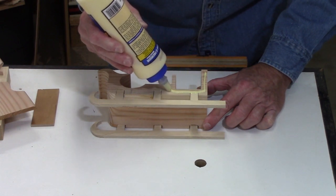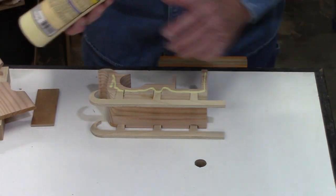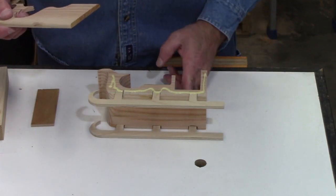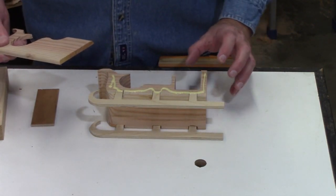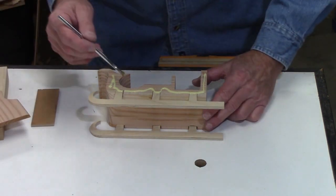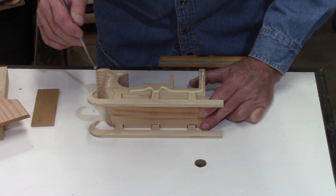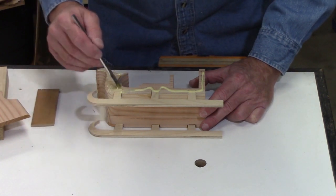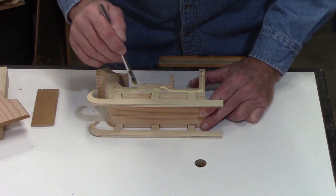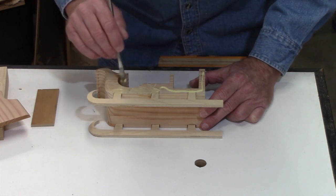And these are going to line up mostly, but you're going to have some issues because you have wood movement. When you start taking off a thin piece of wood, and this is thick, and you take out these blocks, things shrink and expand and move a little bit different from each other. So you've got to keep that in mind, that you're just going to do the best you can and do the rest of your lineup by just sanding everything into place, filling in all the little mistakes you made here and there along the way with either some putty and some glue and some sawdust, or some putty, whatever you want to do.